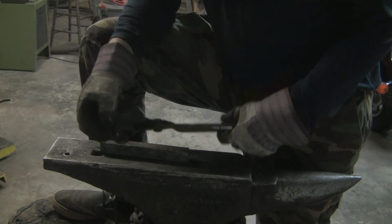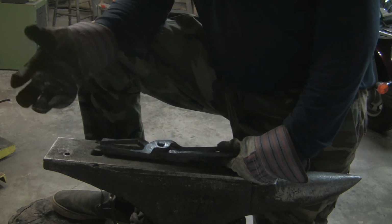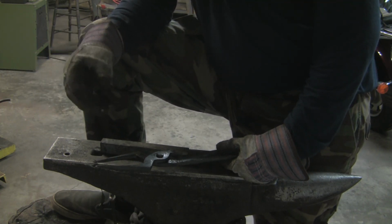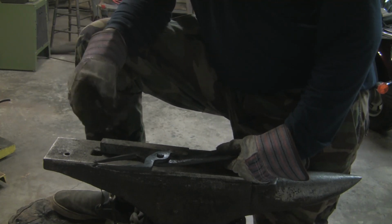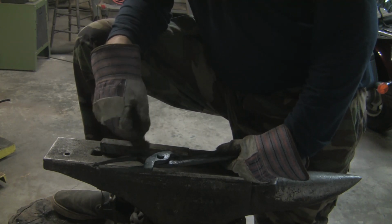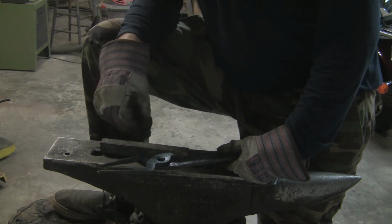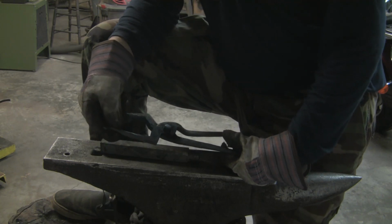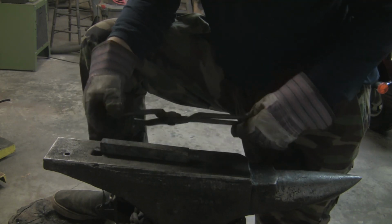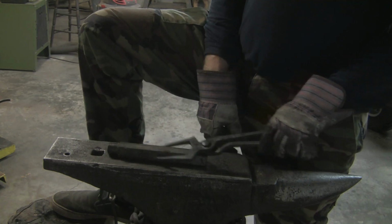And like I said, I've got one more set of bolt jaw tongs over there that I'll probably use to make something really small. I don't have anything that'll fit like 1/8 inch stock. I've been trying to get into smaller and smaller pieces, especially if you're doing leaves. You forge the leaf, you do your taper, you draw it down, and you get it ready to do the scroll or the curl or the hoop. I want some tongs to hold that really small material that could be anywhere from 1/8 of an inch to 3/16 of an inch. I've got some tongs over there that'll hold 1/4 inch stock, but they just don't seem to quite work out. And as much as I drop stuff, I gotta get as close to the dimensions that it's supposed to hold as I can.